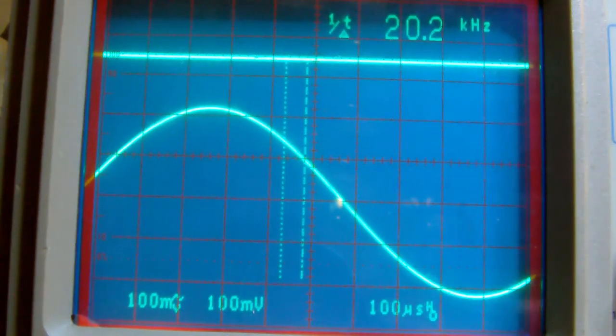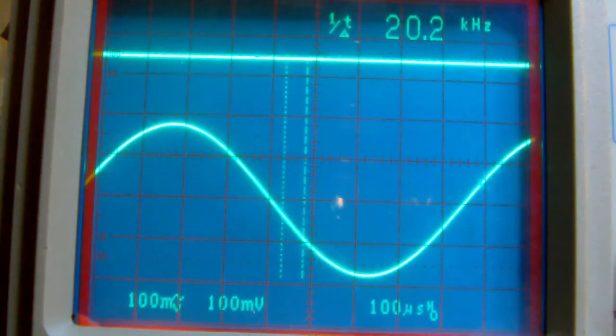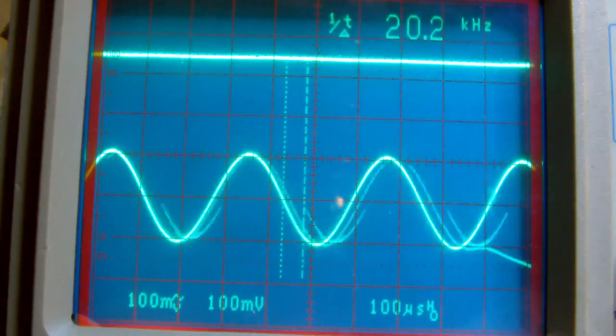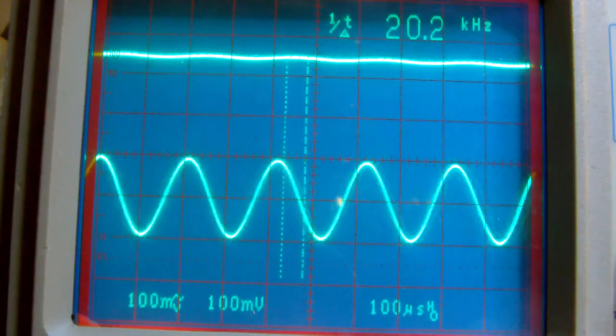Alright. So what I'm going to do now is slowly ramp up the frequency I pump into the filter. And I'm going to tell you at how many kilohertz we are, okay? So right now what you're seeing is 800 hertz. If I drop a bit, let's say to 400 hertz, you can see the low tone, so for the woofer, goes almost off the chart. So let's go to 1,500 hertz. There you go. Let's go to 3 kilohertz. This is 3 kilohertz. 4. 5.